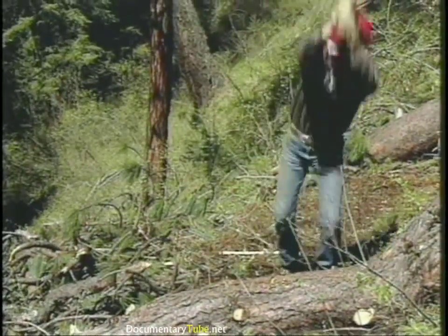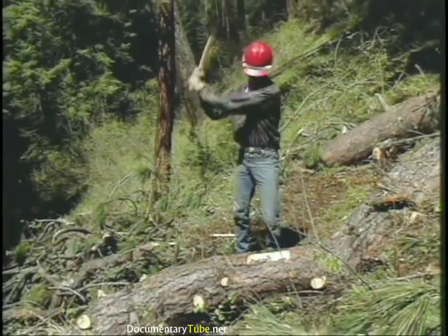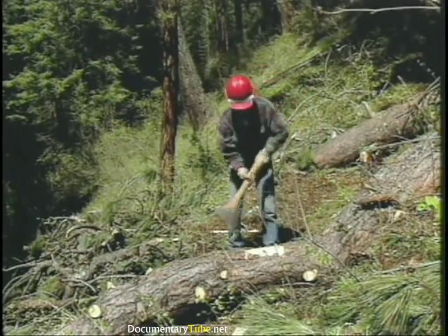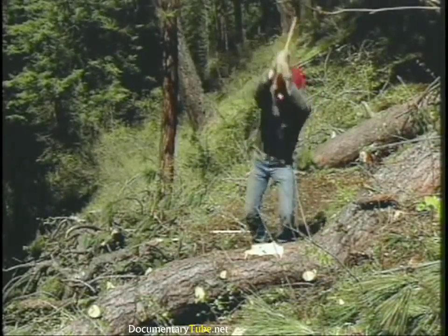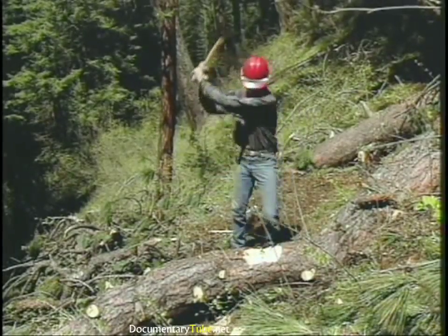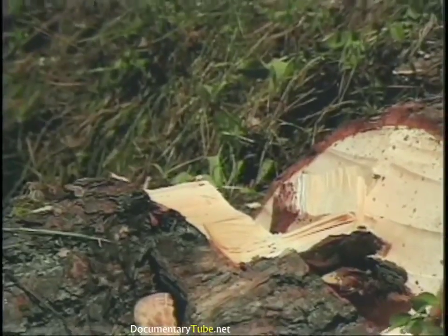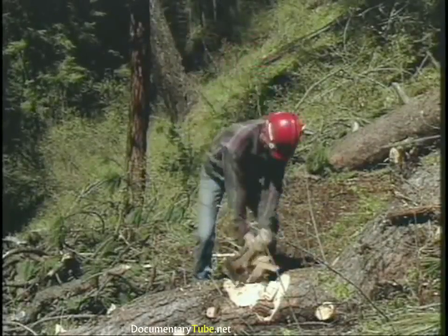Try to be as efficient as possible. Strike that wood as many times as it takes to completely sever your cutting surface and then move to the other side, instead of alternating chops — three times in succession and then breaking it. On a large log, you may not be able to remove your first chips by making a wide cut, so you'll start with a narrower V in your cut and cut down until the V comes to closure or to a point. Then go back up and reopen your cut so that it's wider.